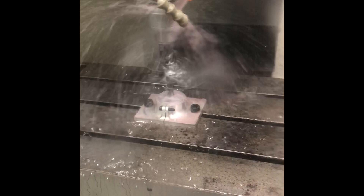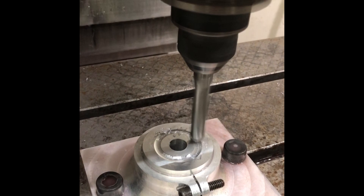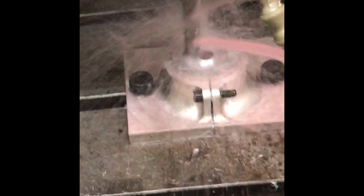The Fadal is running a quick face operation and then the peck operation to clear that hole out. I shut the coolant off so you can get a better look at the taper — this is a half-inch two-flute ball mill running about half speed. Once you get a good view of it, pull the coolant back on and let it hog out. All told there's about 10 minutes of machining to do both sides, and there we have our finished part off the mill.